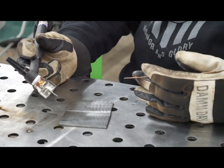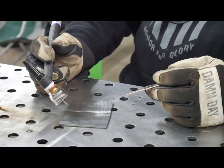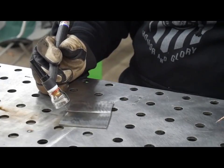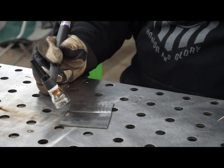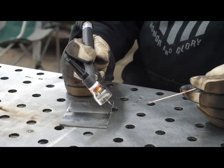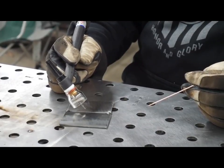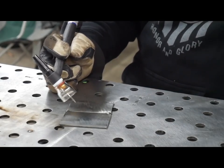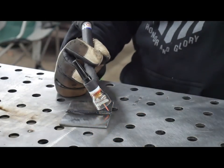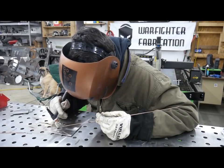Now we're going to do joints. This joint is the easiest of all the joints — it's a butt weld. One of the main reasons you keep your TIG welder at max amps is when you go to tack. When you tack, you go to full pedal for about half a second. Now you're going to take the principles you just learned doing the plates and use them on the butt weld. It's basically the same thing — get a nice tight fit up and your weld will come out perfect. Now Nino is going to do his butt weld.